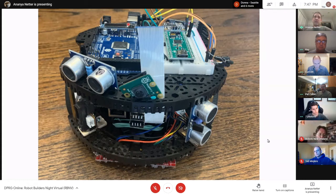So it turned out that the OLED display was also a source of trouble. I initially thought it wasn't the case, but it turns out the OLED display occasionally goes into a state where it just pulls down one of the I2C lines and holds it down.